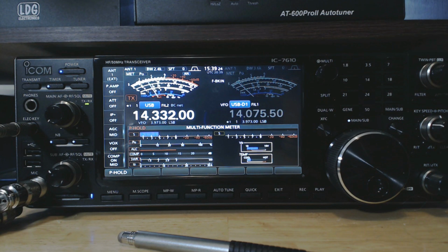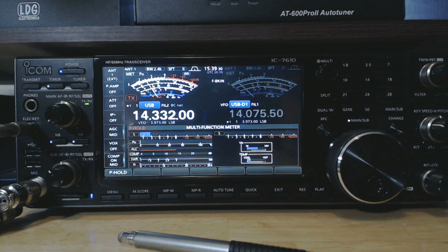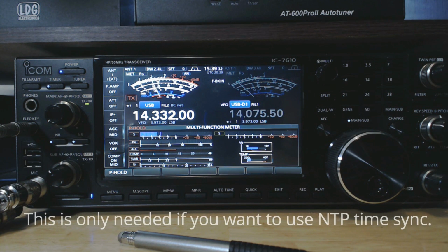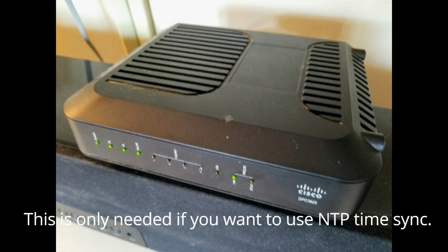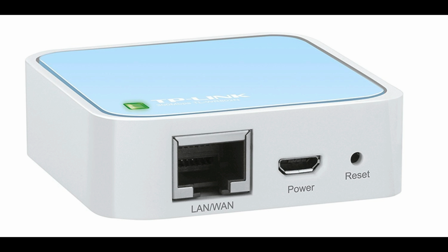Now, there's an RJ45 port on the back of the radio. And what you want to do is connect a cable to it and run it to your router. Now, if your router is in a different room or on a different floor and you don't want to run a cable, you can use a wireless access point or bridge. I'll put a link below.